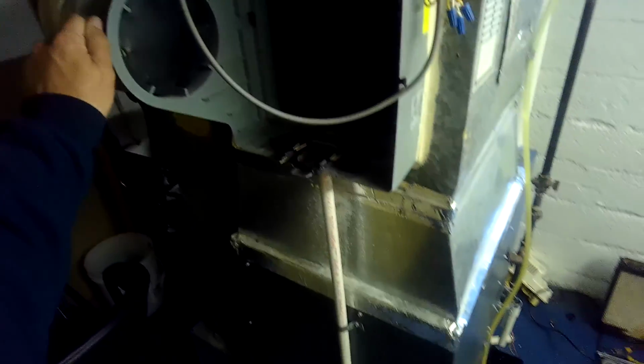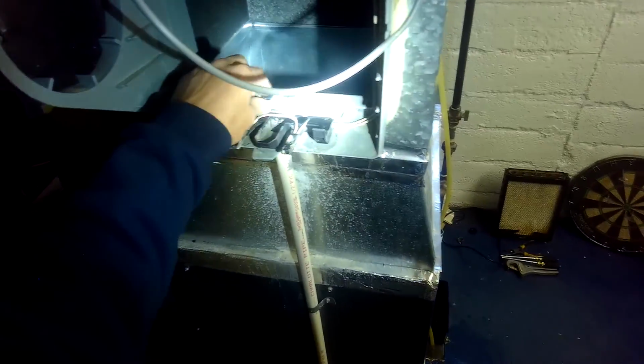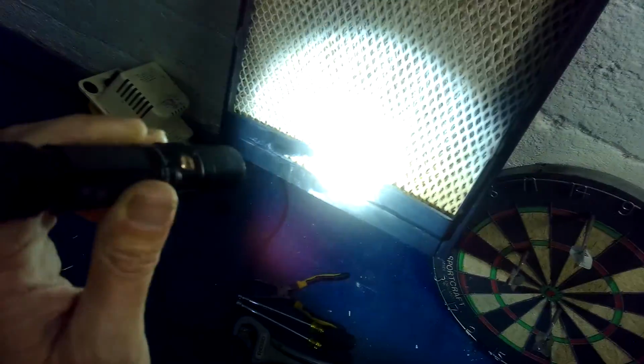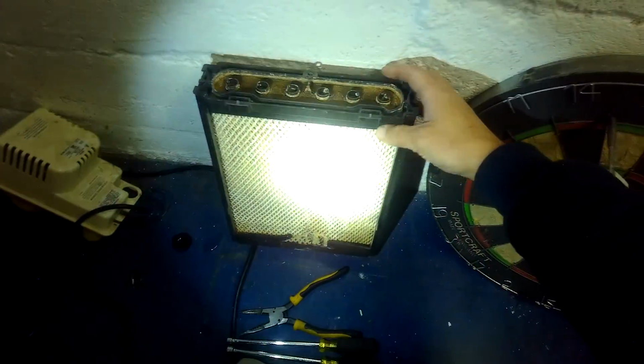Alright, the homeowner was also saying that he was trying to work on the humidifier last month and it's leaking. So I took out the water panel, and a lot of pieces of the actual casing of the water panel holder, the frame, as you can see, it looks like it's just kind of melted away. Plus this water panel is kind of shot too. So they need to get a new panel and a new case for it, the frame for it. April Air 400. I'll make sure the water is off. But we can also resolve that maybe tomorrow or during the week.